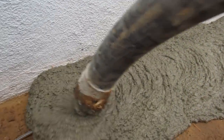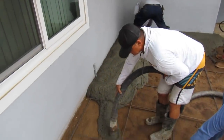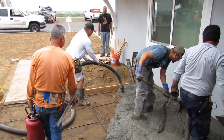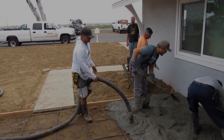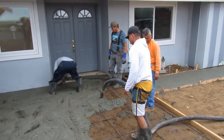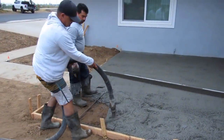Most of the time you'll plug on the prime out or the washout. The washout is tricky because you're incorporating water and it can separate the mix — sand can pack you up, or rocks. When the mix separates, the rock goes ahead of the sand. If I'm sitting pumping for a long time and the hopper is full with mud in the chute and it's hot, the pump vibrates like a vibrator and it'll vibrate the sand down to the bottom, packing you up. I'll run it all the way down to the bottom of the hopper, shake the chute out, then tell the driver to put more mud in.